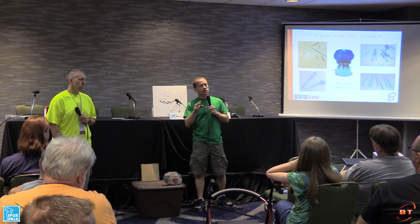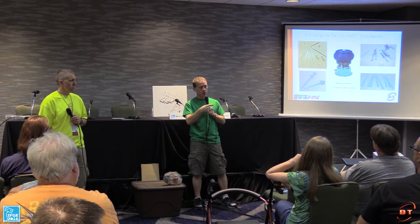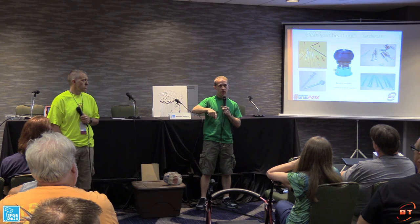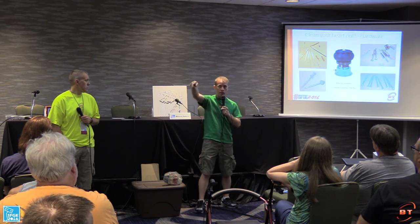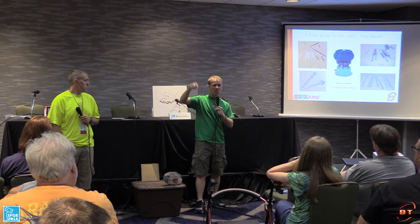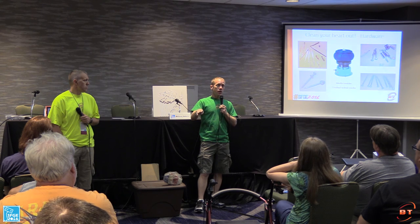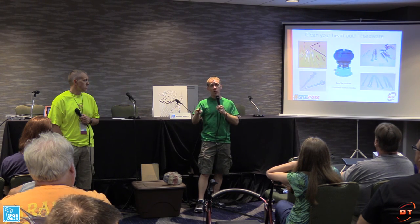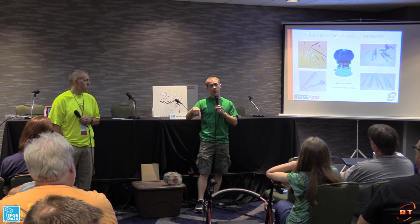What I have done in small spaces, and actually this is a good point, I didn't think to put this in here. If there's a place where the ball falls on the playfield, like if you've got a wire form that comes down to your inlanes and the ball's always dropping there, once I've got the machine clean, if I touch that, generally that area is worn. If I touch it up, or even if I don't, if it's still in good shape, I'll put a mylar square over it.